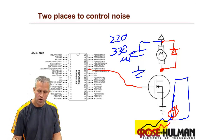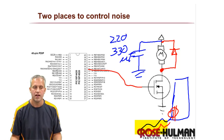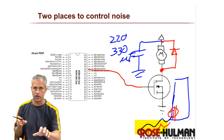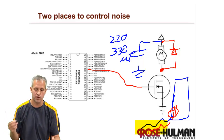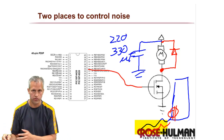An interesting sidebar: most power supplies have a decoupling capacitor built into them. If you're driving an LED and you unplug it from the wall, the LED will actually stay on for a little bit — that's because of the decoupling capacitor inside the power supply. The problem is it's so far away that you want to add your own near the circuit.